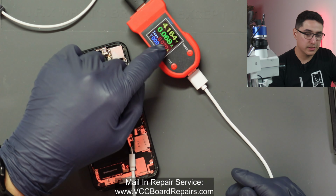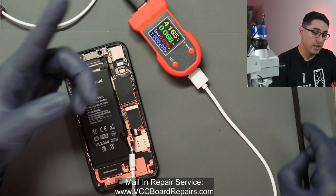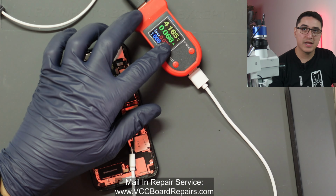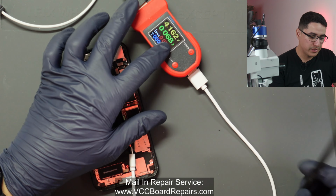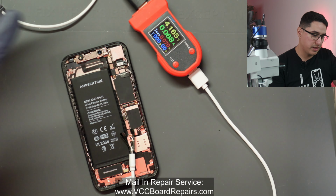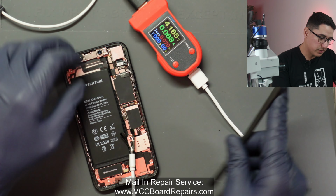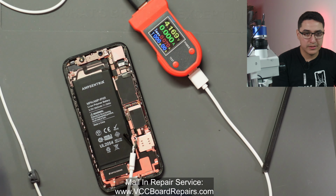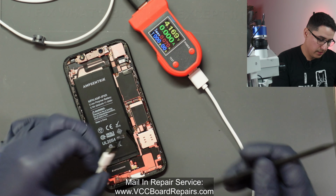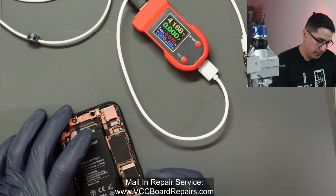So this is a key sign that you're in DFU mode. It's not always, but in a good percentage of cases where you get around 68 milliamps when you prompt to boot, it usually implies DFU mode. And the best way to test is to plug in the charging cable and listen for that chime. And then you can use 3uTools to check what it's being detected as.